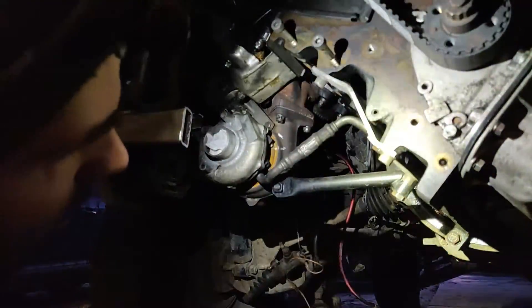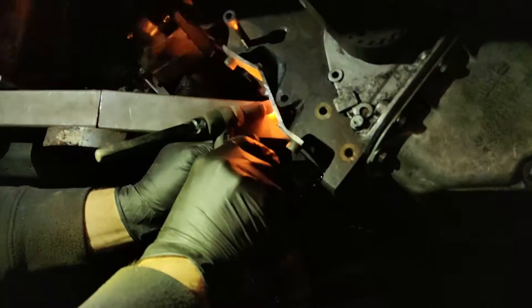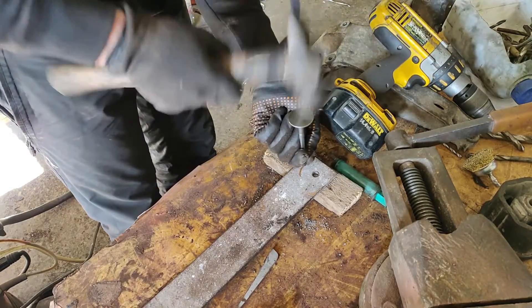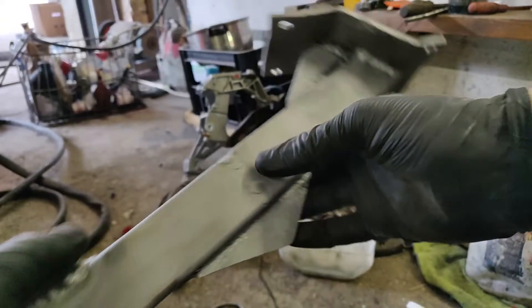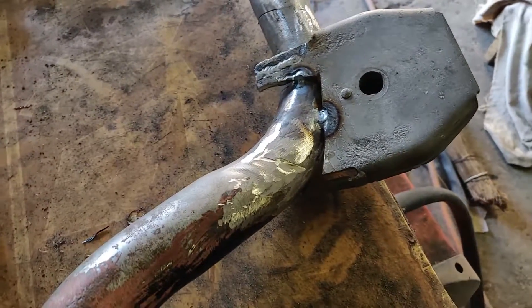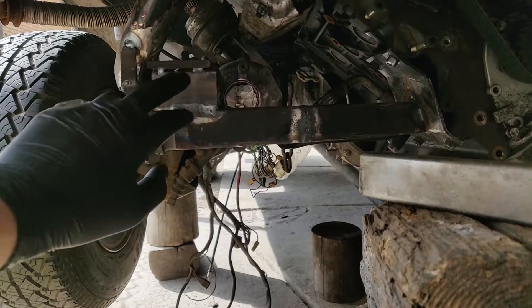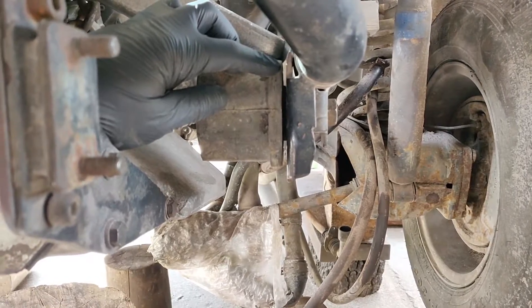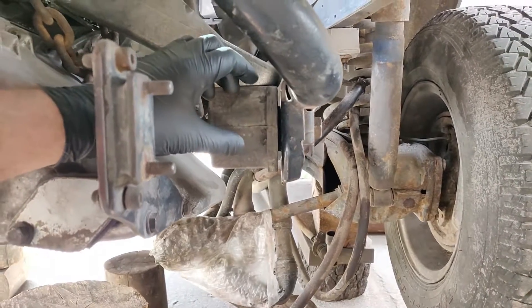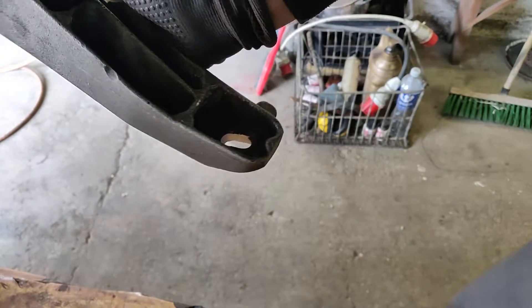I have finished reinforcing the bottom where I welded. As my father used to say: measure nine times, then you can cut. I made not very good measurements — it's not sitting properly, I need to remake it. I lowered it here because on this side I didn't have a gap, and the lower gap was really wide and it was not sitting straight. The hole is extended now — the end is cut off and it's not going to touch the actual bracket anymore.